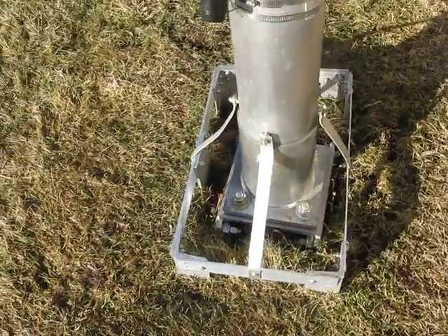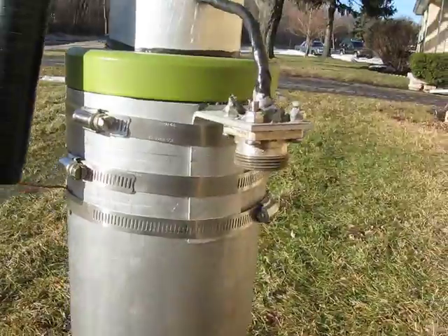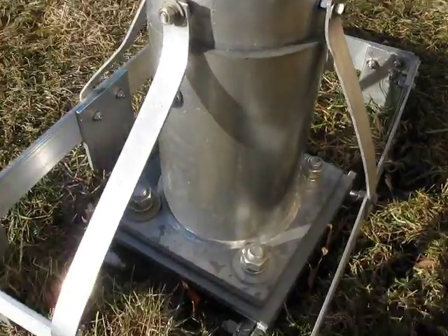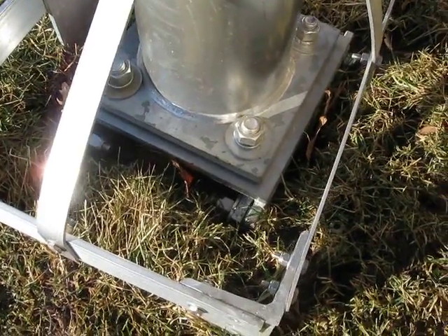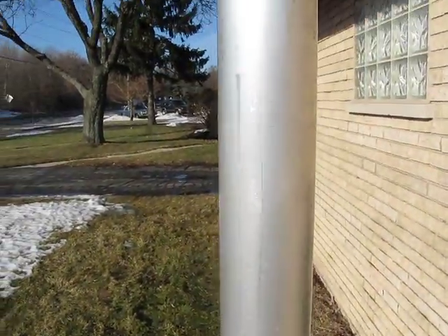All the radials are buried. There are 120 radials. The feed point uses a 7/16ths DIN connector with a six-inch quarter-wall base tube. There's the plate steel fold-over mount — I can hinge it up and down.